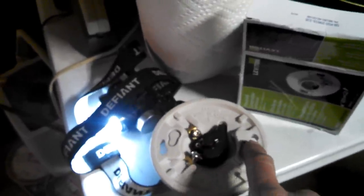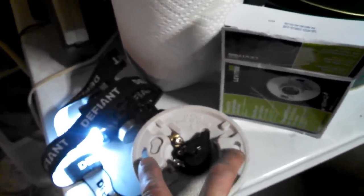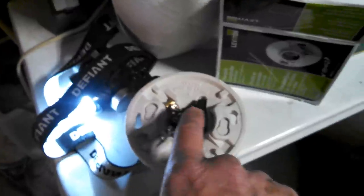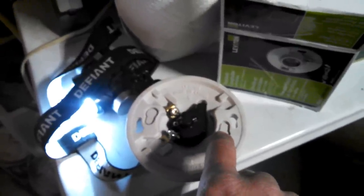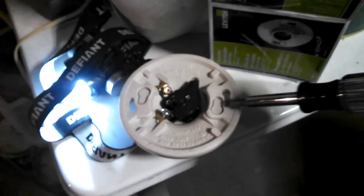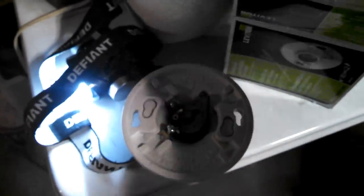And the two outside holes are open. Most of the boxes are sized for that screw distance. But if you have a smaller box, you knock these middle ones out with a flat-bladed screwdriver and a couple of taps on a hammer. Or you could just stick the screwdriver in the side and start twisting it. They'll usually crack right out. And that's how you open up those guys.